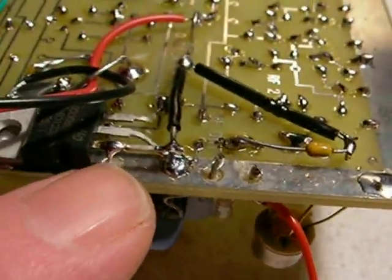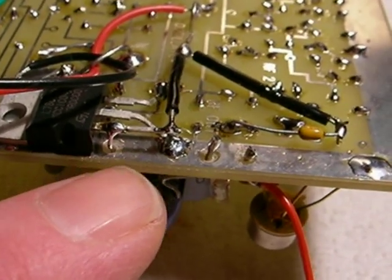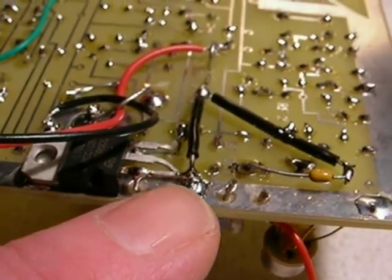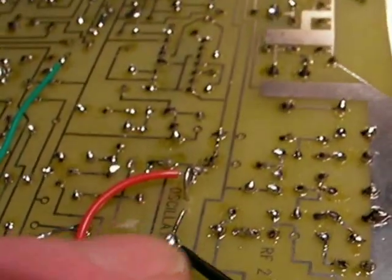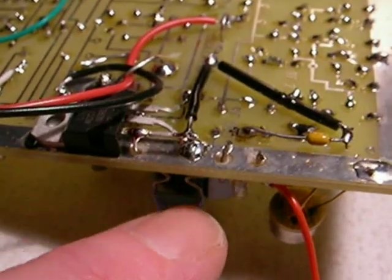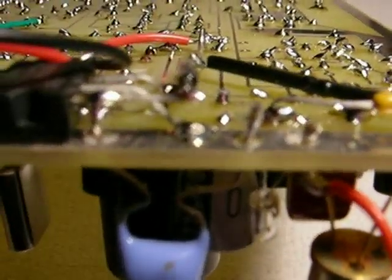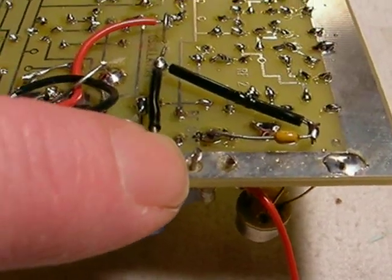If it doesn't light, take a look at this here. Go back over your wiring again. The first terminal of the coil has to solder right to this terminal of the regulator right here. That's one terminal of your coil — making sure nothing is shorting out in here. The feed to the 78L09 is a straight wire going over to the electrolytic capacitor you added. The other side of the coil comes through the board and joins one of the wires of the bulb.